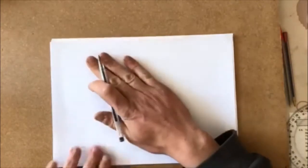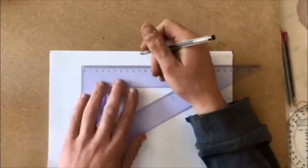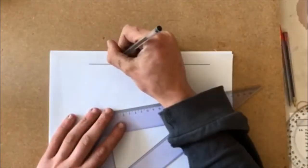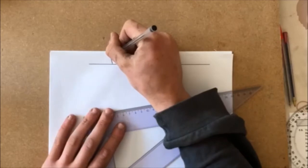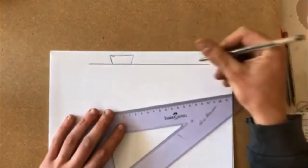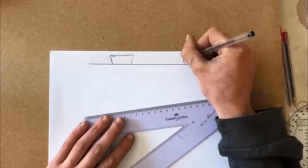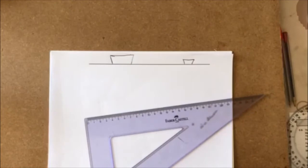So what happens is in your hot water system you've got your tanks up in your attic. You've got 2 of them, so I'm going to draw a line up the top here with my attic, and draw in my 2 tanks. You've got a big tank for storing water and supplying water to your cylinder, and you've got a small tank here that supplies water to the stove for heating. So this is in constant circulation.